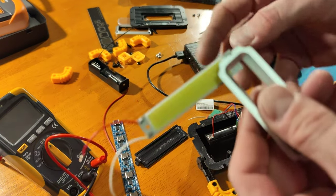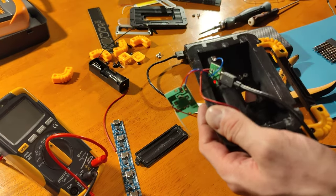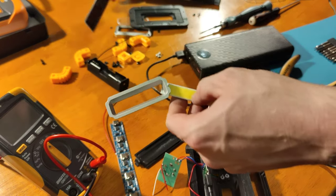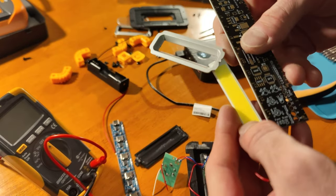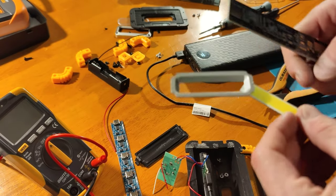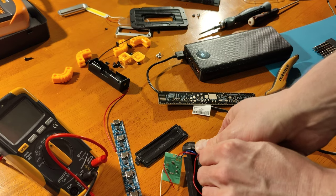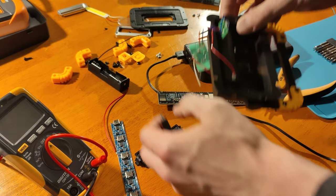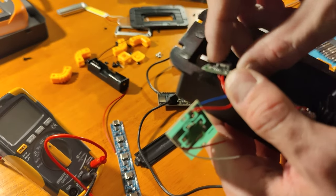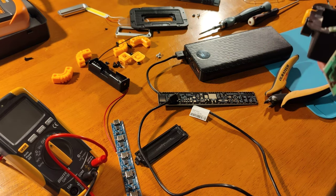Basic aluminium heatsink, not too thick - but it is 2 watts maximum. The LiPo holder built into this is handy, and the case is probably good if you retrofit a different chip on it. The COB is roughly 10mm by 60mm. For any LiPo batteries you care about, I wouldn't use this setup. Or if you do, cut this charging circuit out, chuck it straight in the bin, and put something that's actually got proper voltage regulation in it.